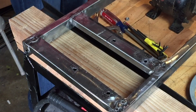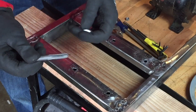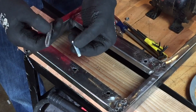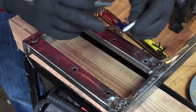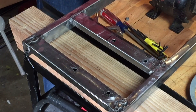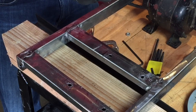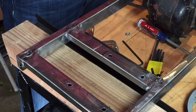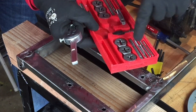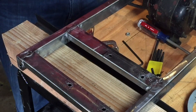I love working with metal because it's something I didn't do when I was younger and it's really easy and fun. Here is my tap — this is a 3/8 by 16, meaning 16 threads per inch — and I've got a 3/8-by-16 screw that's going to go all the way through, then I'll put a nut on the other side. I'm going to start tapping using my tapping kit, which you can get at any hardware store. These are taps — they tap into the metal. On the other side, these are called dies: they take a non-threaded rod and turn it into a threaded rod, so you can build your own nuts and bolts.